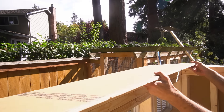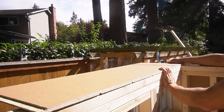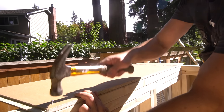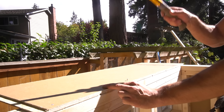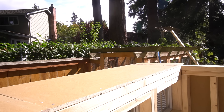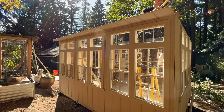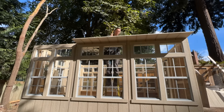These soffit panels lay flat against our top plate because this is going to be our soffit for our roofline. I line up each panel so it's flush against the inside of our 2x4s and nail them accordingly with the 2 inch long nails that come with our kit. Once this first panel is nailed down, you then align the lap and lip panel with the adjacent one. Since each panel is 4 feet wide and our structure is 12 feet wide, each side gets 3 panels.